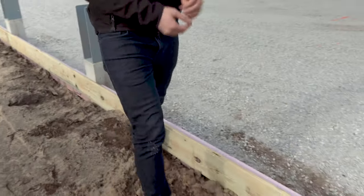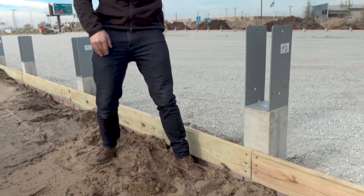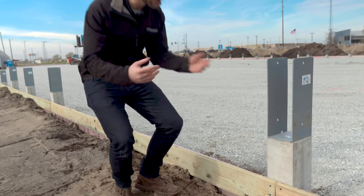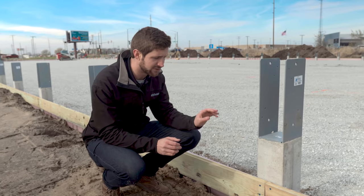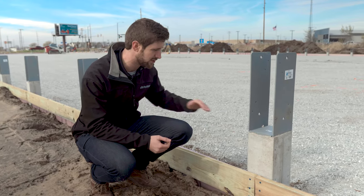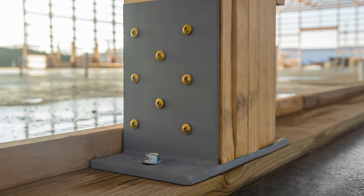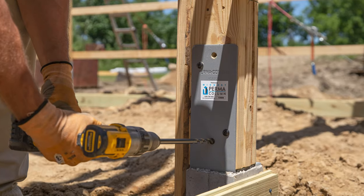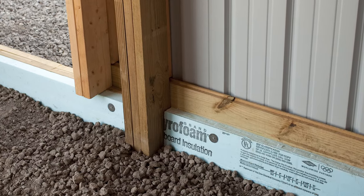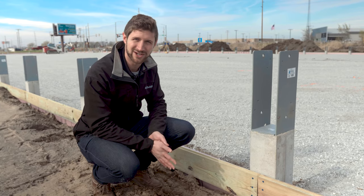You can see that the baseboard is tacked onto your permacolumn on both sides and all the way around your building. These are specific baseboard features to talk to your sales rep about. You can also do concrete bracketing — pour your concrete, pour a footer, and bracket your columns onto that. So those are your three main column options: concrete bracketing, permacolumn, and laminated columns. Talk to your sales rep as you're looking at your project.